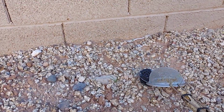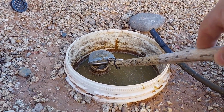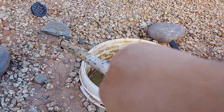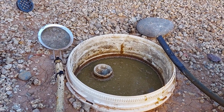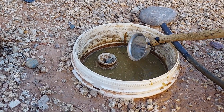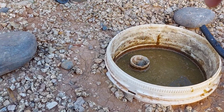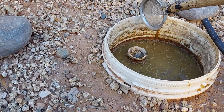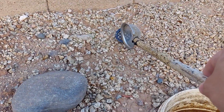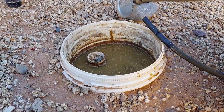And I had put this thing here, which is a little drain cap, in here on top of this. The reason for that is because my dog, he's a good boy, but he's not the brightest bulb in the box. He would eat grass and eat all kinds of stuff. And what was happening is anything in his poop would float to the top and go down this tube. And I bet that's what's clogging it too. So you can use something like this too. Put it on top like this, you know what I mean? So this would filter out the hair and all the other stuff he got into. So yeah, you can do that for the top.